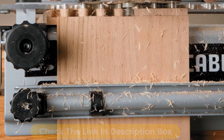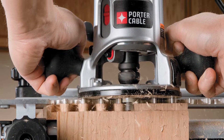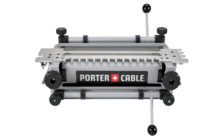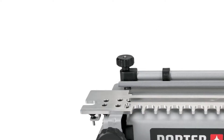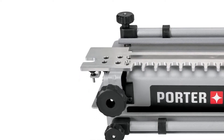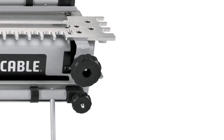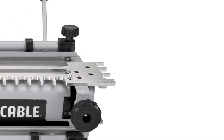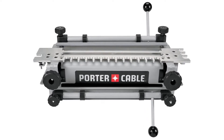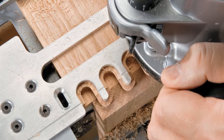The machined aluminum template ensures maximum accuracy when using the jig. Setting up the Porter Cable 4210 is very easy, as it features template alignment lines and router bit depth gauges. The jig also features heavy-duty cam-type clamps with locking bars backed with sandpaper, which helps secure wood pieces firmly. On-board instructions provide clear guidance on how to make use of it. Overall, this Porter Cable 4210 is the ideal jig for cutting half-blind and sliding dovetails not wider than 12 inches, especially for boxes and cabinet drawers.